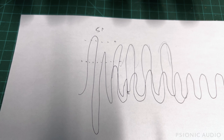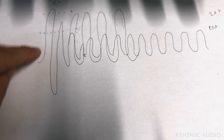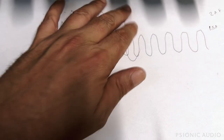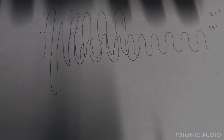For those who do this kind of thing, if anyone has a better idea of how to visually demonstrate current — rather than voltage waveforms that musicians already relate to audio waveforms — that would be great. Anyway, for the owner of this Deluxe Reverb, I think he's just a couple dollars' worth of time delay 2 amp fuses away from a completely trustworthy amp again. So that's a good outcome — we'll see you later.